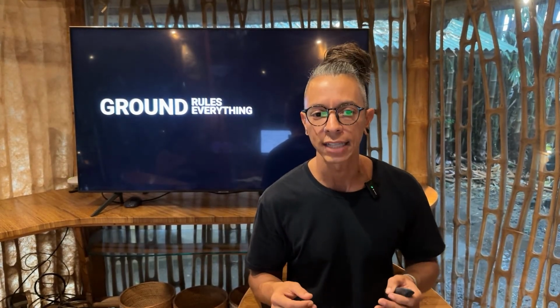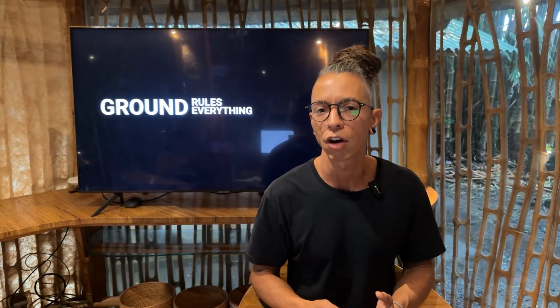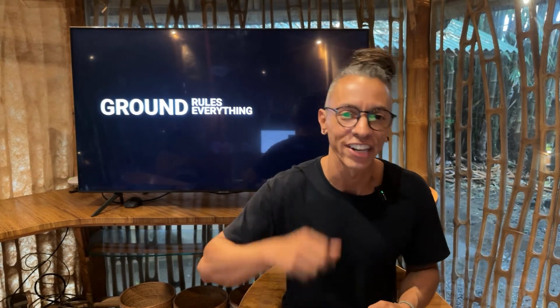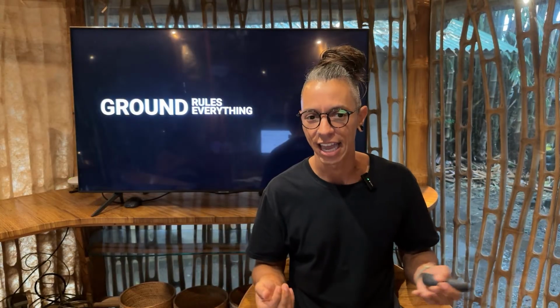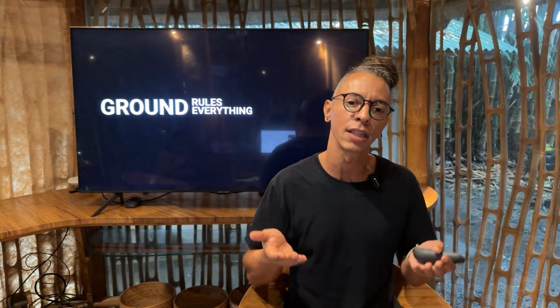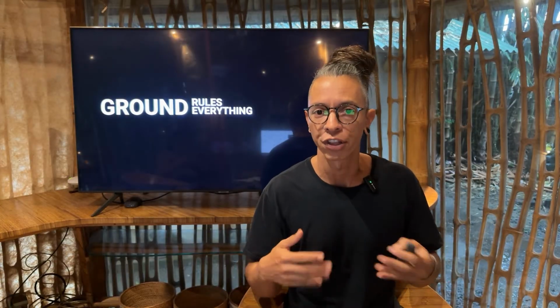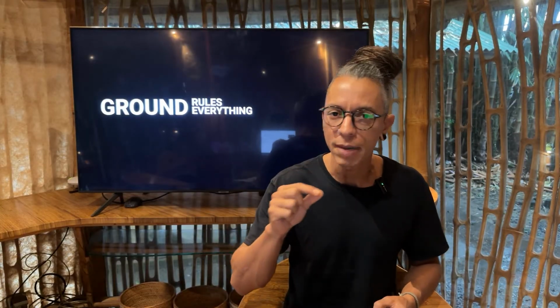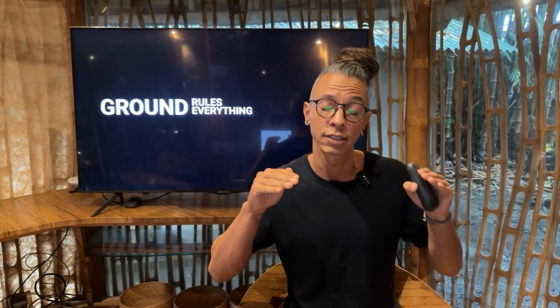So the ground rules everything. And what I mean with that is, think that if you build on a soft or wet soil without preparation, without any soil improvement, it's like planting a post into a birthday cake. So it is going to sink. Every building sinks, but don't tell this to your clients. Foundations will help to make the building sink evenly over the years. So every single year or a couple of years, like a couple of millimeters, the building will start sinking.